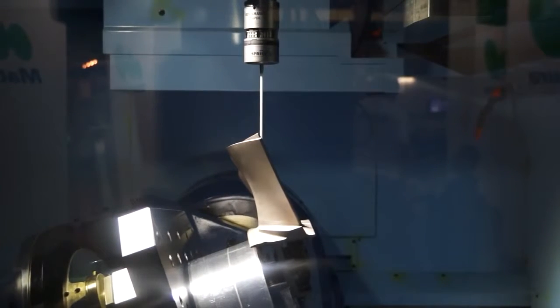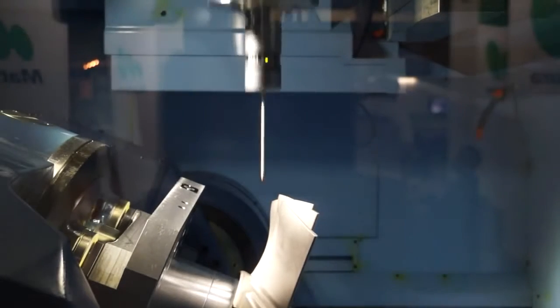So Mark, this is a new product from Renishaw. Can you tell us about it? This is a sprint system from Renishaw. This is the next level to on-machine probing. So this will give you scanning capability. Now the benefits are it's improved cycle time. So over traditional touch trigger probing, it will give you a reduction in up to 2/3.